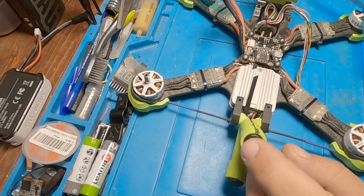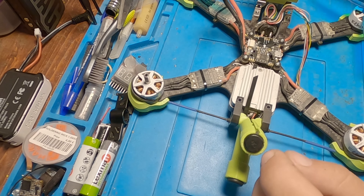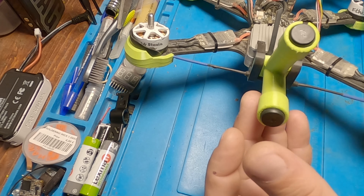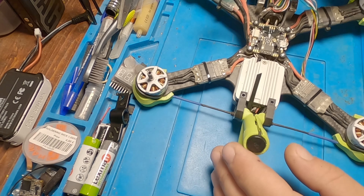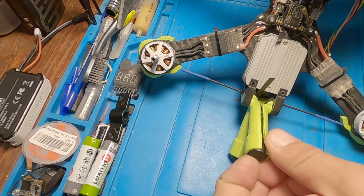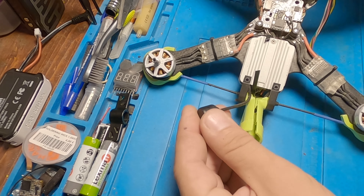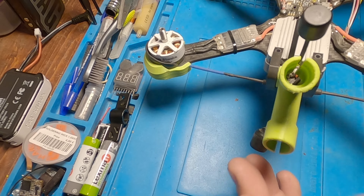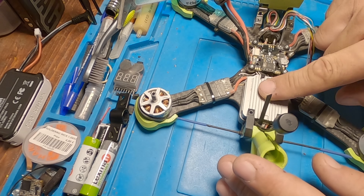Because I no longer have the plug-and-play MMCX connection, I couldn't use the 3D-printed antenna holders anymore. So I had to go into CAD and redesign them with a hole in the middle so I can still remove the antennas from the drone if I want to work on it. They come out from the top and also from the bottom very easily. Let me take it out, open the air unit, and show you exactly how I connect them.